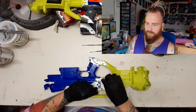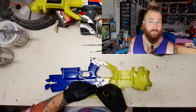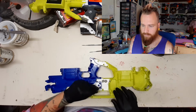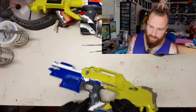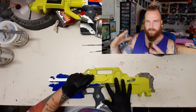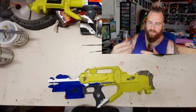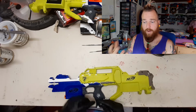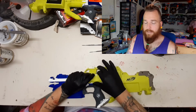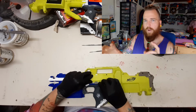So now you can see I'm flipping over the Raven to the inside, and you can see where the white stuff, that's the Smoothcast 65D, holds the integration in the first place. But you can see those little gaps, and I'm just going to push in some epoxy here to make sure that the epoxy on the outside and the epoxy on the inside bind, and therefore it'll create that solid bond around the plastic, and it'll be right where it is. And yeah, that's what I do with most of the spaces where I put epoxy in.